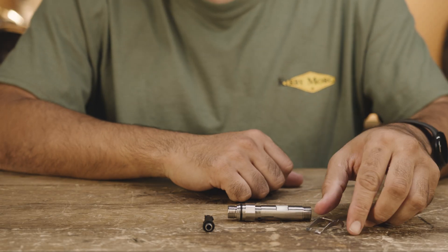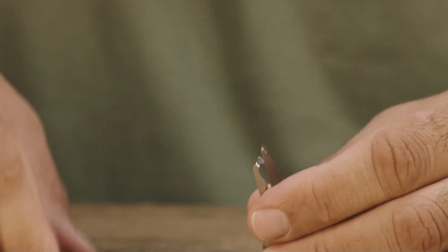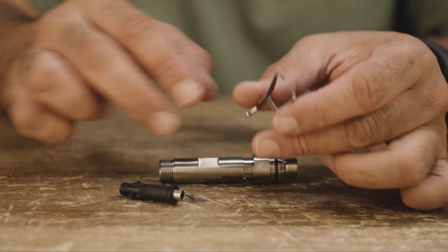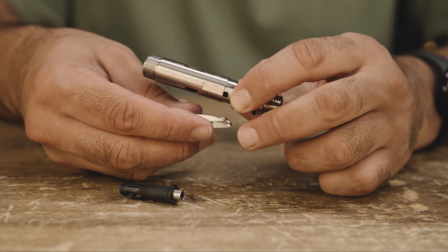Begin by installing the lever arm. Press the lever arm feet together until they touch. Hang it from the stainless steel tube on the inlet valve to confirm proper spacing. Position the lever arm so the cross member rests beneath the flat spot on the main tube.